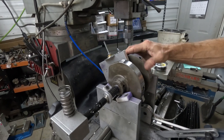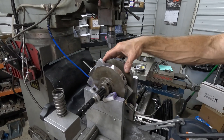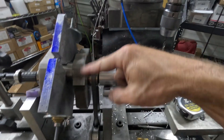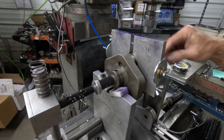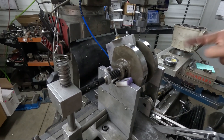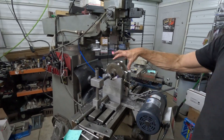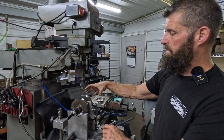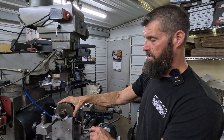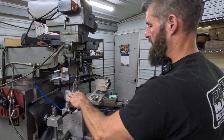That Briggs crank I just did was the exact same way — it had two exact holes, same depth, same diameter on both counterweights, but the left side was worse than the right side. You can see up here it's got all of this material but not over here, so that's counteracting, and that's why this side is heavier than that side. So I'm gonna rip it back out of here and put it in the lathe. We're gonna whittle some more off these counterweights. The out of balance is roughly centered, especially on this side, so if we can turn the bulk of it off without drilling a bunch of holes it looks better and there's probably less windage.